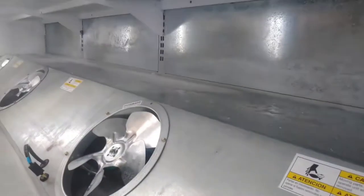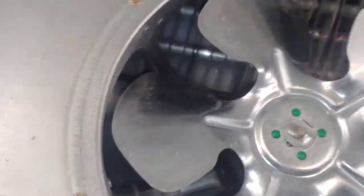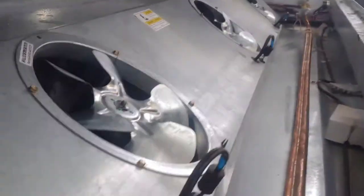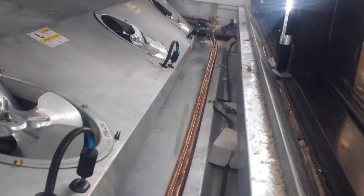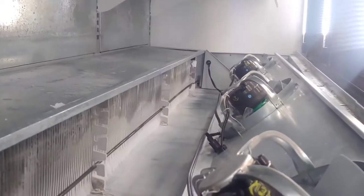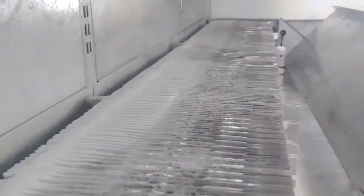You're going to want to take the end screws out, and also the end screws off that one. There are screws in the back, another one right there in the middle, and the same on the other side. Once all your screws are out — you can see the ice — this panel here, lift the front and then slide out to the back. Lift it, lean it forward, pull off the panel covering the evaporator, and flip that one over too. Now you can see the full extent of the ice.